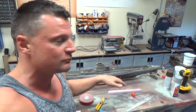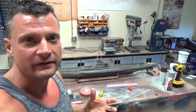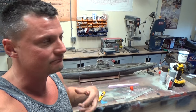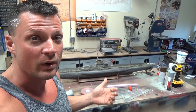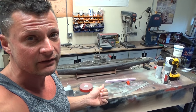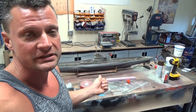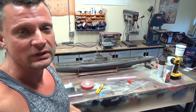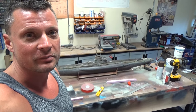There's a way you could scientifically calculate the exact amount of foam or flotation that you need, but I kind of guess based on my experience how much to put in and where. So what I'm going to do now is drop this in the water and see what it does. It hasn't seen water yet, so this is its maiden dunk in the testing pool — let's see if we need to add foam or weight and continue with the trimming process.